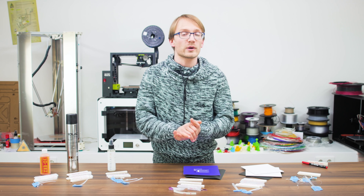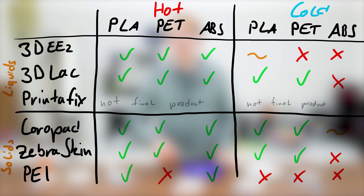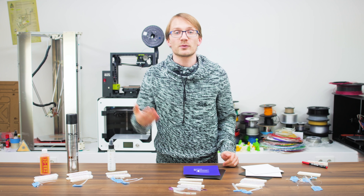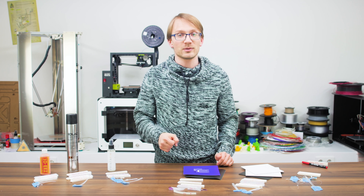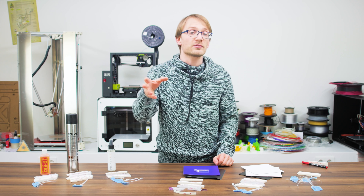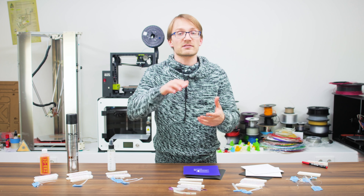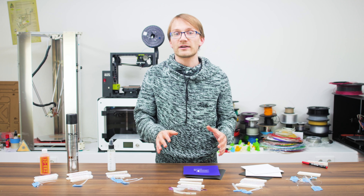So do we have a winner that's the best surface? Well, no — not because they all suck, but because they're all good for their own specific use cases. Pick the one that fits you best, and keep in mind that none of these surfaces can do any sort of magic and bend the laws of physics. If you try to print in a cold basement room, especially with an unheated bed, you're going to get less adhesion than when you're propping up your printer right next to the fireplace with a beefy heated bed. You can increase the adhesion with any of these surfaces by moving the nozzle closer to the bed, increasing the hotend temperature for the first layer, or using a raft or a brim.